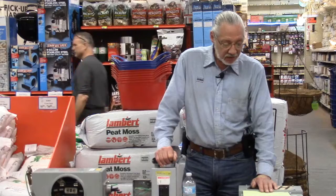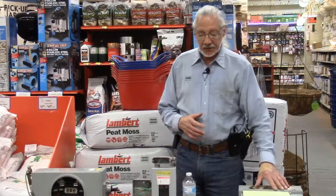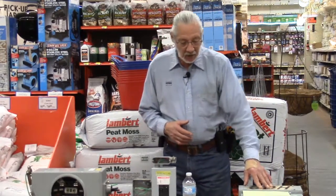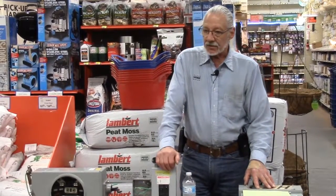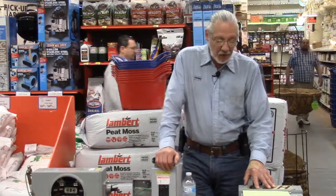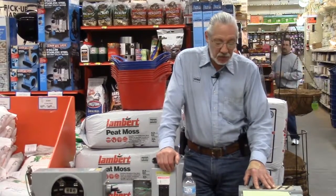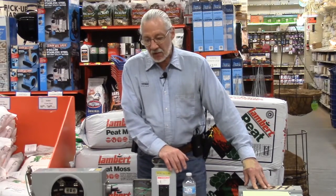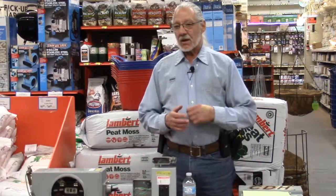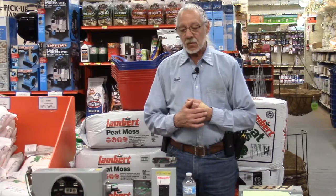The base of electricity. First off, we're talking about putting a new piece of equipment in. You're going to want to evaluate your old panel, whether it's fuse or circuit breakers. And when I say evaluate, I mean measure and identify that old panel. One, measure, I'm talking about amperage. First thing you want to know is, number one, what amperage is coming into your house. And number two, what your amperage draw is.